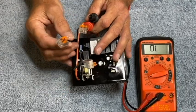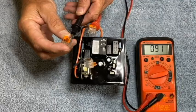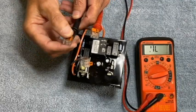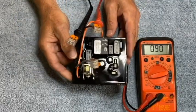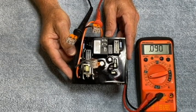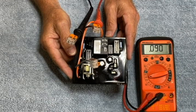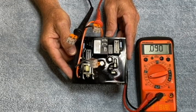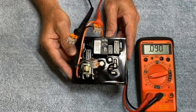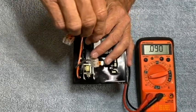While I've got my red probe in here, I can test the identifying resistor by going from brown to black — regardless of orientation — and I should read somewhere between 86k and 96k. Since we're in the million ohm scale it would be represented as 0.086 to 0.096. As you can see we've got 0.090, so that would be a good reading for our identifying resistor.